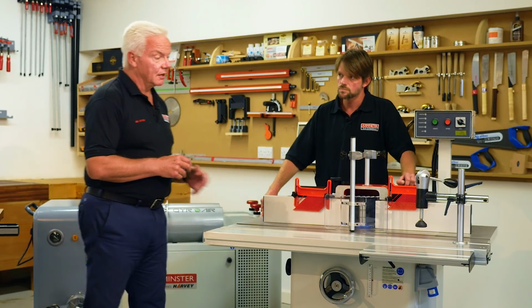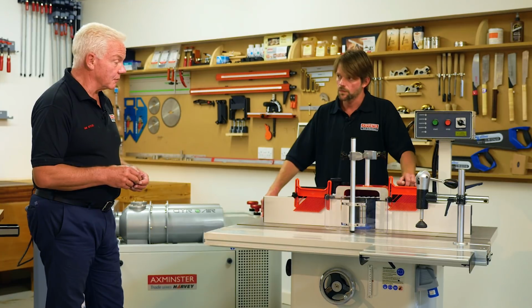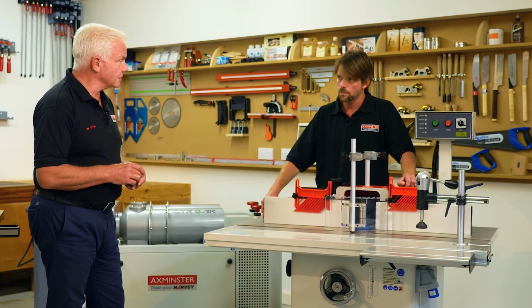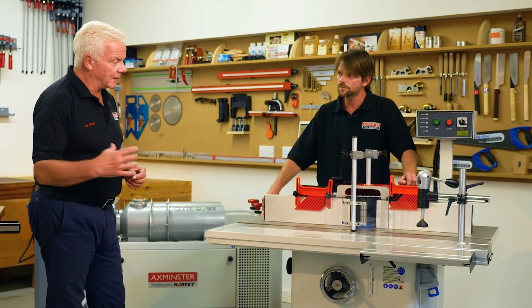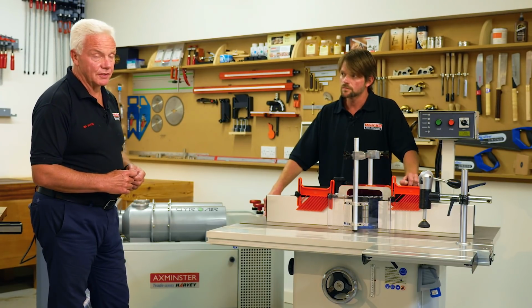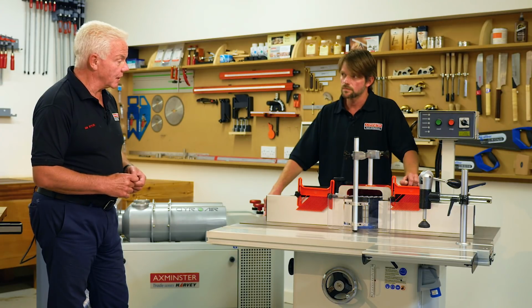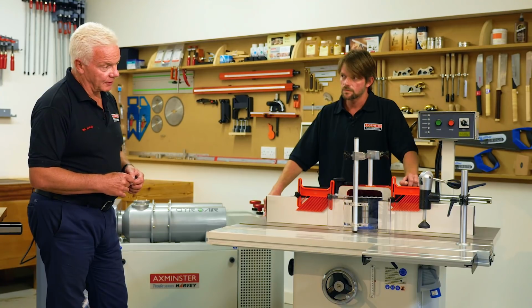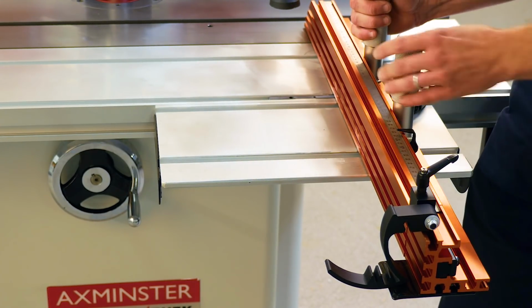It's not industrial. A trade machine for somebody who's producing small batches of windows, mouldings. I think a lot of people have been using routers just recently, inverted routers. And we're going to try and get people to use the spindle moulder. It's very cost efficient, it's safer, it's easier, quicker to use. And if you're running out reasonable lengths of moulding, I've got to say it's always my favourite machine over and above a router.